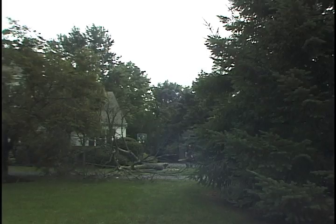I know I learned a very important lesson here myself: as a faller, I have to be in good communication with whoever's in charge of that pull line to make sure they don't pull early. They need to not pull until I give them the hand signal, and they need to know that ahead of time, every time.